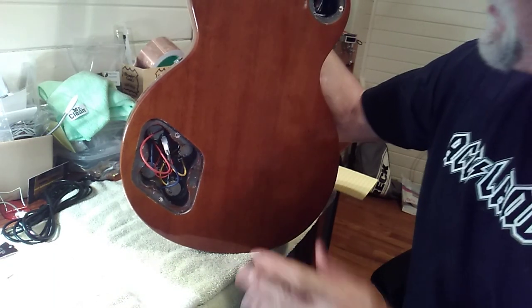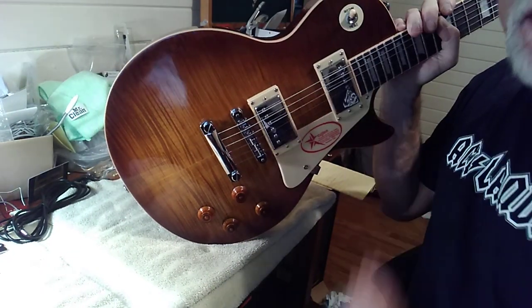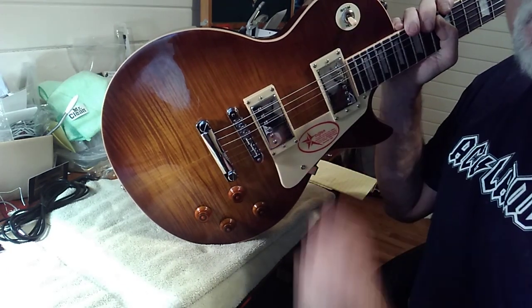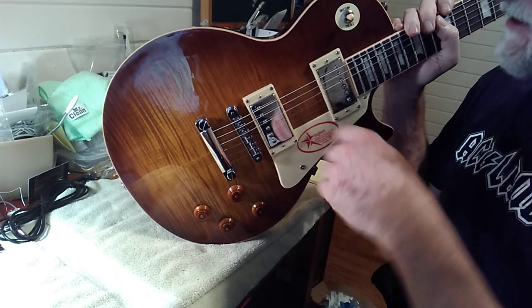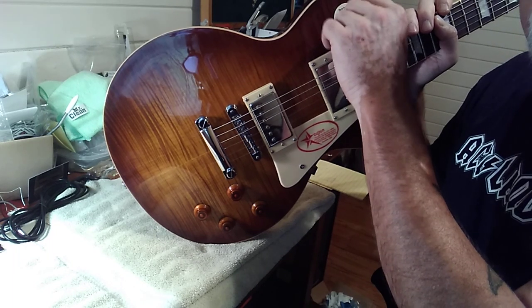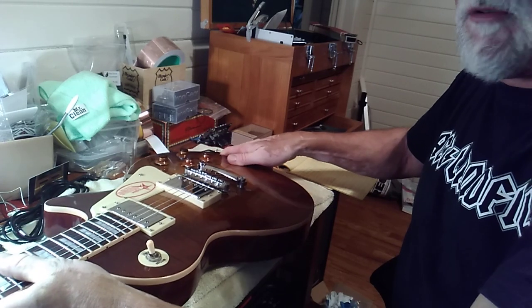And something that I noticed right away is, you got the neck position, you got both pickups, and then this is supposed to be just the bridge, but in this position, both pickups still work just like it was in the middle. At a glance I hadn't seen anything wrong with the wire, and I think it's actually the switch isn't switching, but that doesn't matter because all that's coming out anyway. So that's kind of what we got there.